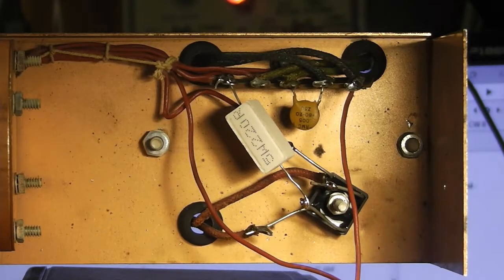You'll hear people on internet forums say, 'Oh, I'll never put a dropping resistor in there, just change it out with a regular old diode.' And yeah, most of the time tubes have pretty good tolerance — they're not rated right at, say, 150 volts with no headroom, they can handle more. Now take a modern chip made for five volts and vary it too much and you'll burn it out. Tubes can handle swings much better. But this here — I was getting almost 130 to 143 volts coming off the positive side of the rectifier.